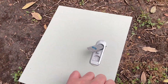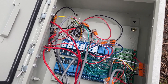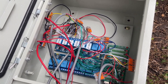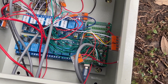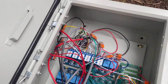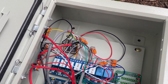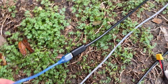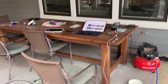This is the electronics that I've built up. I've got 16 relays — only a couple are populated for this test, like the spark plug, a couple different fuel valves, and the oxygen valve. This is basically a microcontroller with a screw terminal shield, so we've got a ton of channels to work with. This is actually a power supply from a drone being used as a voltage regulator — it steps down to a couple different useful voltages — and USB control runs back to my laptop that's actually running the tests.